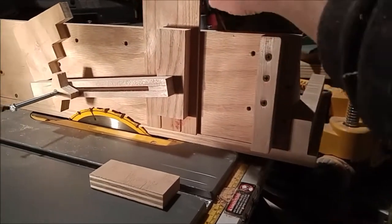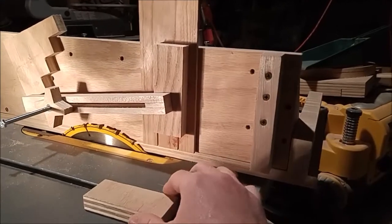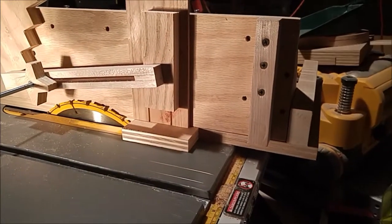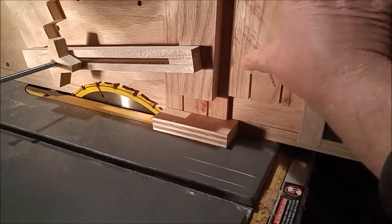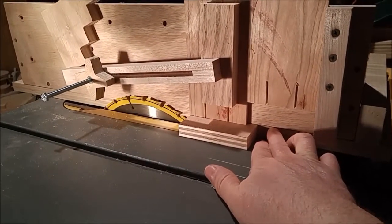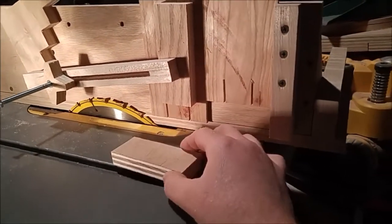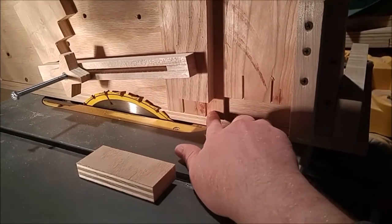The way I set up this piece — since I don't want it right up against the backstop because the bevel cut will cut right down into that backstop area — first I'll set the height using a piece of three-quarter-inch plywood, which is the same height as the table saw sled. Then I'll take another piece of wood that I know is square and space that off from the backstop, so now I know this is straight up and down and I've got the height correct off of the table saw sled. The idea is to cut this 12-degree bevel cut at the midpoint of the thickness of this piece of cherry hardwood.